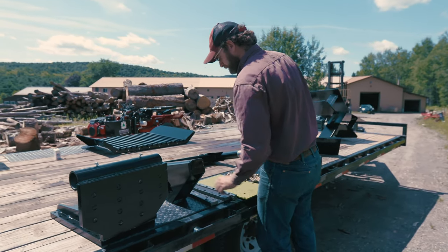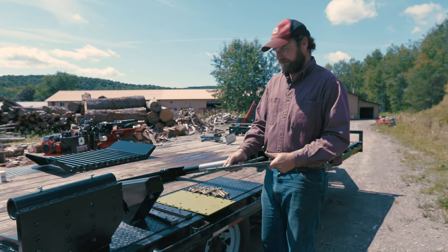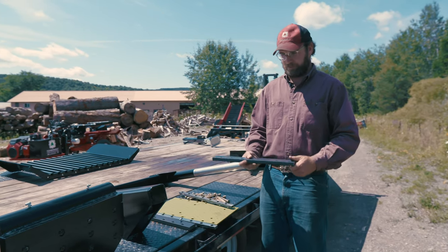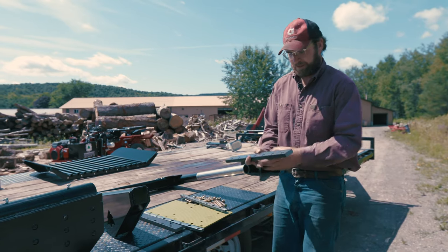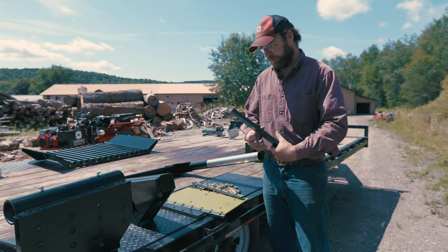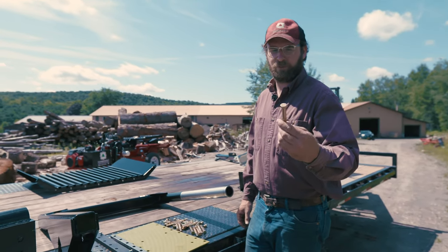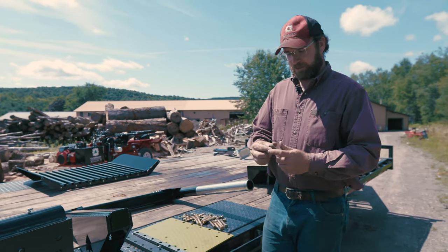This is held in with our spacer plates, and this is what guides it side to side against your I-beam. And then underneath, you have our wear strips, and these grab the bottom of the I-beam, so when you get any lift, this prevents the lifts. Again, we have grease zerts installed here. That's going to put grease in between this and the bottom of that I-beam, reducing friction and wear altogether. These are held in with 5/8 bolts. They're 4 inches long. All of our bolts and hardware are all American-made grade 8 bolts.